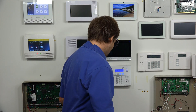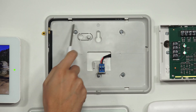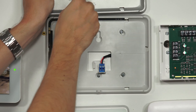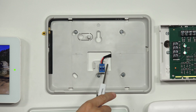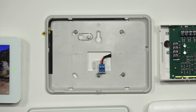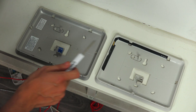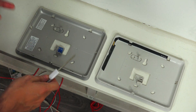Our system is fully powered down. I promised I'd show you the backplate differences. We have the Pro Takeover backplate already installed — you can see it has an antenna up here. That gives the Pro Takeover module a useful range. Without that backplate, you really won't have any useful wireless range. This is the stock one that doesn't have the antenna. You also need to move the blue terminal block from the old backplate to the Pro Takeover backplate. It's easiest to do this when they're not mounted on the wall, lying flat on a table or desk, before mounting the backplate.